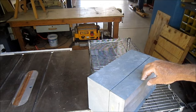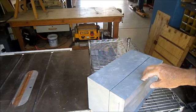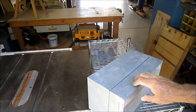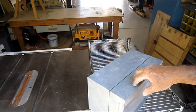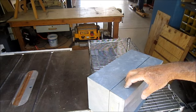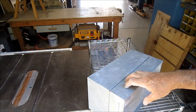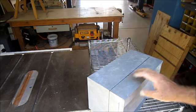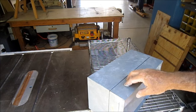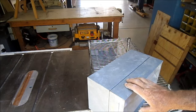I'm going to say 8 years ago, we had some homes where we were having problems with groundwater coming up underneath the house, and these are designed on the master fan unit. It checks humidity, and if the humidity within the crawl space is higher than the humidity in the ambient air outside, then the fans would turn on to evacuate the crawl space. The rest of the foundation vents are open, and these fans are pulling air in from the foundation vents and then exhausting. If the humidity is higher outside, then of course they wouldn't turn on.